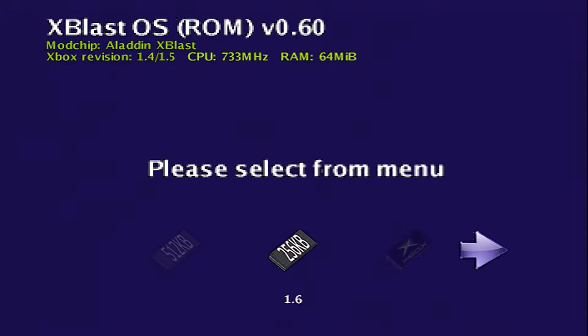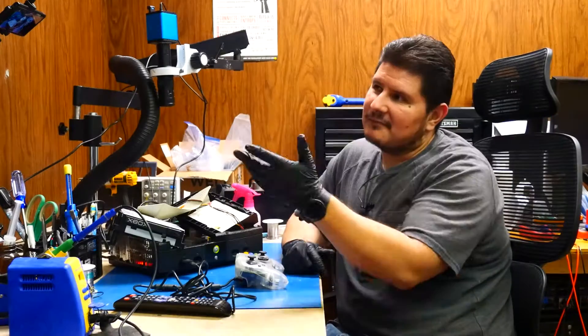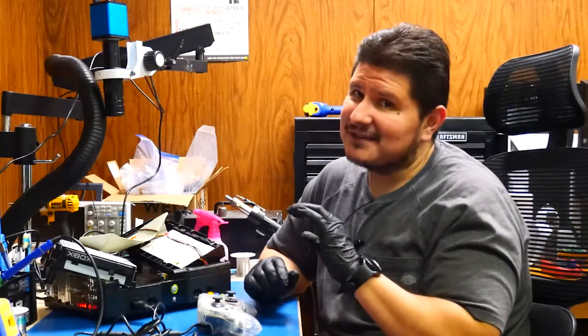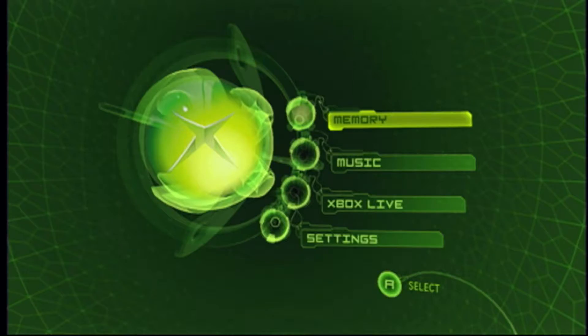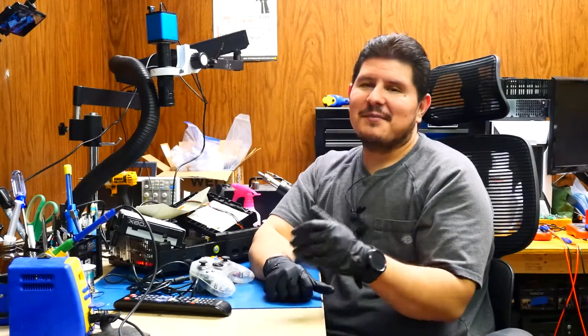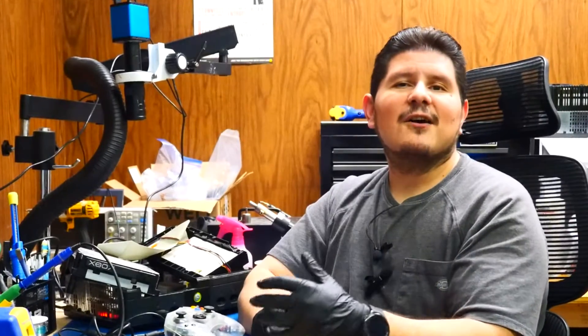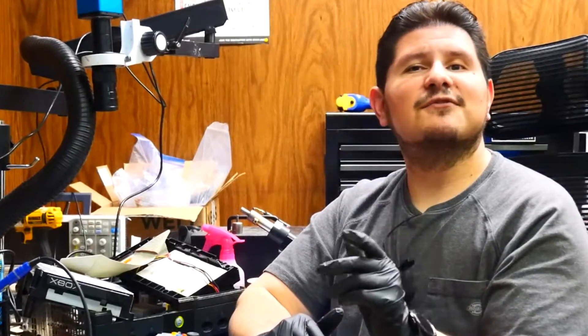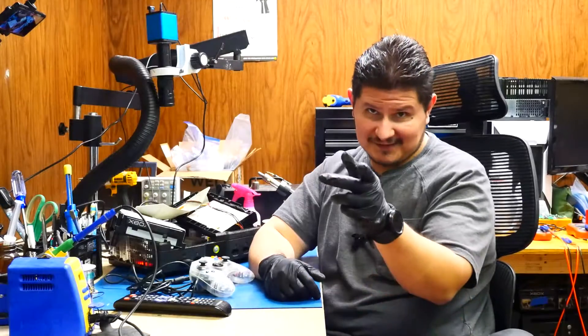And look at that — we can navigate the menus. I'm going to boot into EvoX. And there you are. Color is a little messed up though, and I think that's probably because the capacitors are in pretty bad shape on this console. I don't think replacing just the capacitors in the front of the CPU is going to fix that either. It looks like we booted into the OG Xbox Dash and our EvoX BIOS is working. If you found this video helpful or useful, or if maybe it helped you get your console out of a coma, please remember to leave us a like and subscribe. Thanks for watching — until next time.